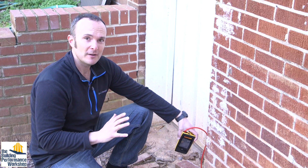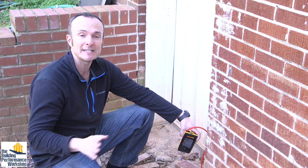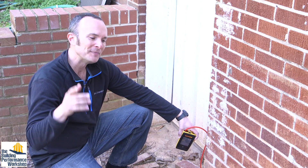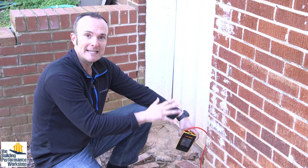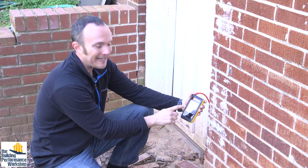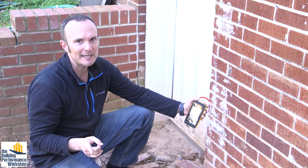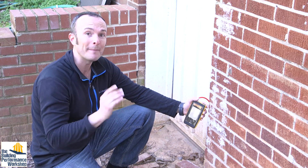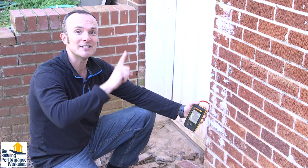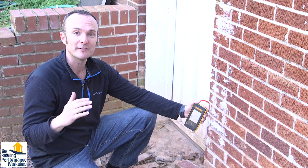We're at the crawl space. In the very first video of this series, we did a zonal pressure test of the crawl space's relationship with outside versus with the house — and found it was 90% connected to outdoors. We did not want that. Right now, we want to know how much more 'inside' we've made it. At the beginning, the zonal pressure inside the crawl space referenced to outside was 5. Right now it's clocked at 20, which means we've moved it significantly more inside — it's now about 40% inside, but still 60% outside. So we can assess how much more work we want to do based on our targets. If we're shooting for 100% inside and 0% outside, we still have quite a way to go. Also, the crawl space is connected to the attic through things like the chimney chase, so work on the attic will also affect crawl space numbers. That's how complex home performance dynamics are.